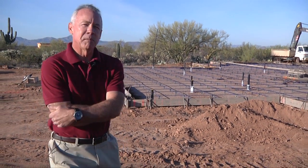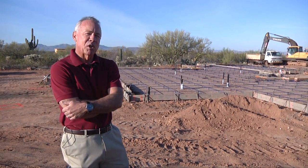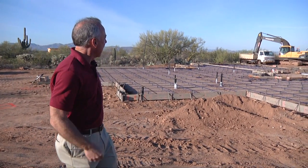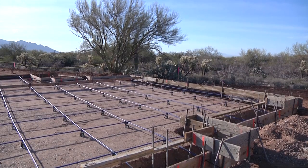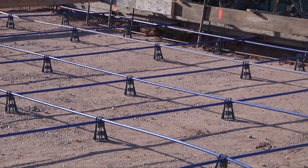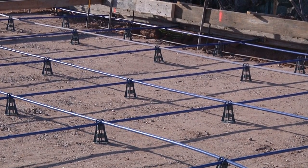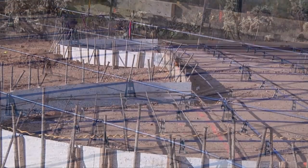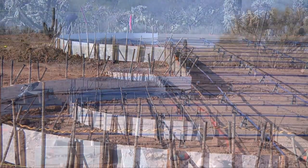This home is ready to be poured — it's going to be poured tomorrow morning. You can see that the cables have all been laid out on a grid, and that's been designed by a structural engineer who calculates what the loads need to be, the cable lengths and sizes, and approves it structurally as part of our planned process.